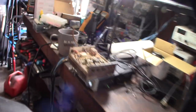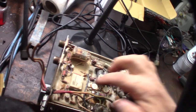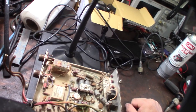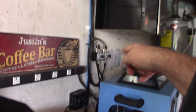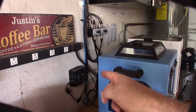I don't want water getting into components - a lot of those parts you just can't get anymore. Can you even get these transistors anymore? I mean I've seen more modern Toshiba ones. This amp has relays, a preamp, and SSB/AM mode. What interests me most about the CB thing is the LSB and USB, because I actually have an SDR Play feeding up to my antennas. There's a lot of action on the 11 meter band. In the future I want to hook it up to a Raspberry Pi.